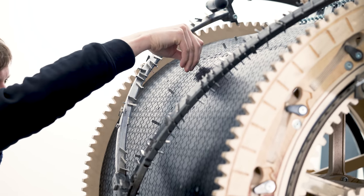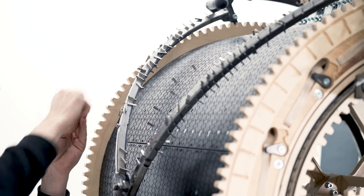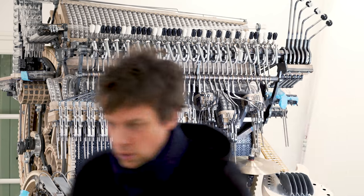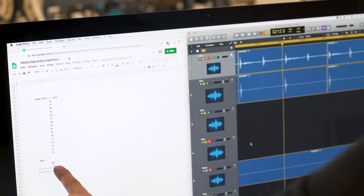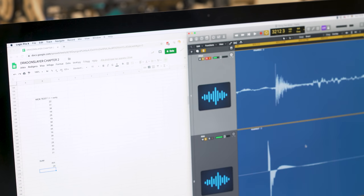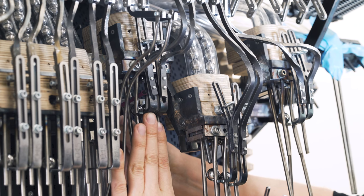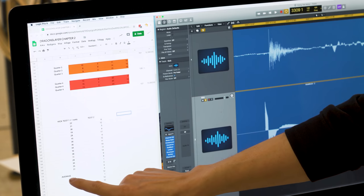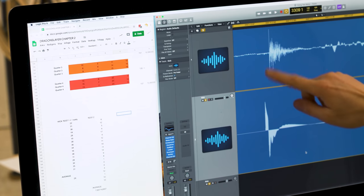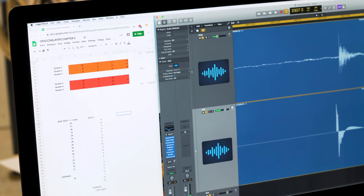I'm going to start by comparing the second kick drum channel with the one we already fixed, adding some extra strokes on the programming wheel. The new kick drum is early - we can see it in the test result, in the waveforms, and we can hear it. Here you can see the discrepancy. One way to adjust the timing is to move this arm up and down - you can shift it up like that. Moving the marble up had a bigger difference than I thought - average is 7 compared to average 29. The kick drum is closer to the hi-hat but still early.